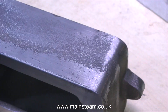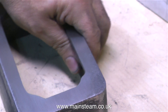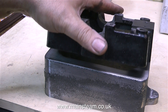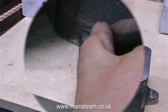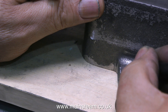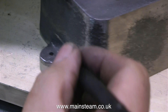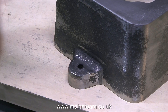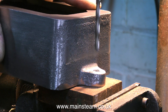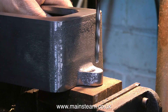In this clip I'm using a small drum sander in my Minicraft drill to finish off the hard-to-reach parts that a file would make a mess of. The component still looks like a casting but is nice and smooth where it needs to be. When I place the sole plate from the original engine parts on top of the box bed it's looking good. For marking hole positions: you don't have to measure and mess about - you can put a black spot where you think the hole should be, and if it looks like it's in the right position, drill a hole there. It seems very simple to me, but I will reiterate - I am not an engineer, I'm a musician. My brain doesn't function like an engineer's brain, and I make no apologies for that.